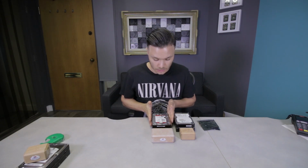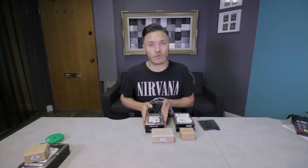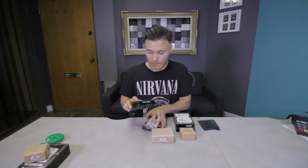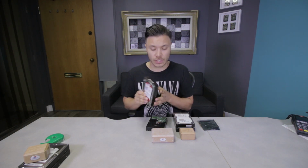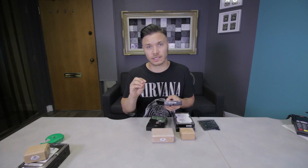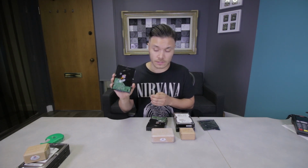The next drive, it's not a very difficult process to perform a head replacement on the Western Digital, especially on the modern ones, but the complexity slightly increases because this drive potentially has platter damage. We will have to pull the head assembly out, inspect the condition of heads as they sit currently in the drive, original heads, that is.